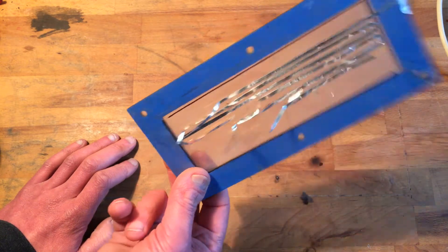I didn't even have time to test it, so this one is going to the bin. I did make a new one, but the results after all this effort were not that great. There's still a peak at 15k and it does reach to 20k, but this peak might be the magnet structure in the way. I don't like it at all. It does sound good though - in the measurements it doesn't look great, but I had several people listen here and nobody mentioned the peak or that it doesn't extend to 20k. They do sound good, they just don't measure as well.